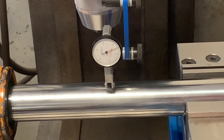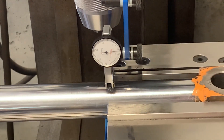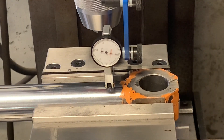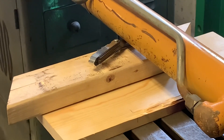It's not much — it's about three thousandths over the whole length. I still need to go up a little bit more on this end.